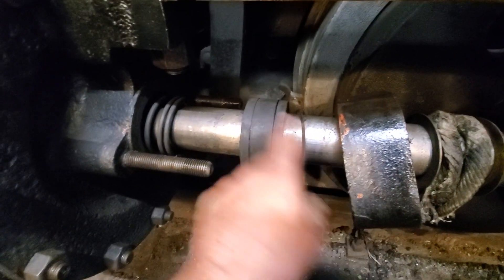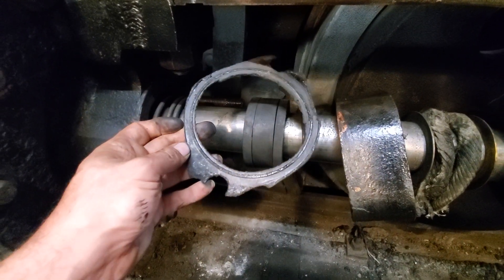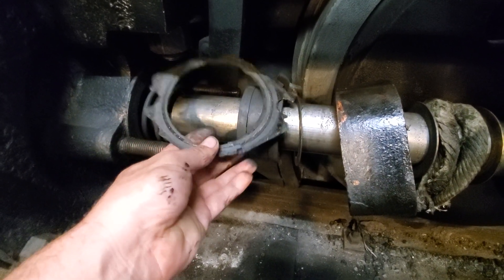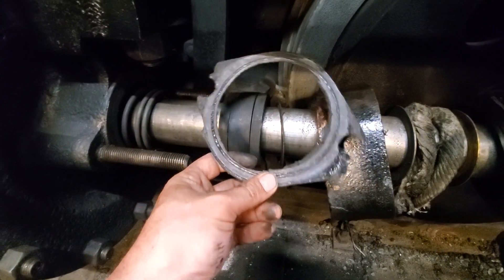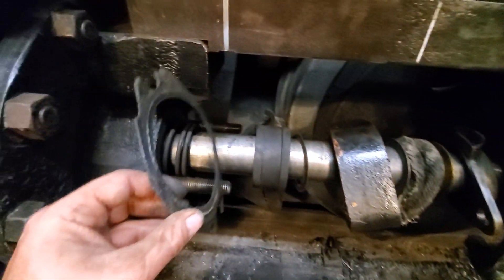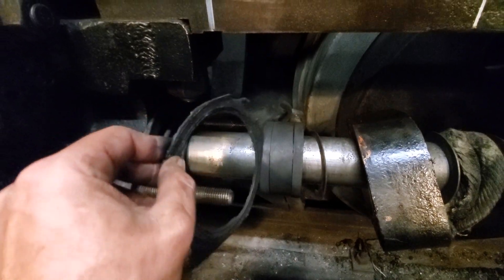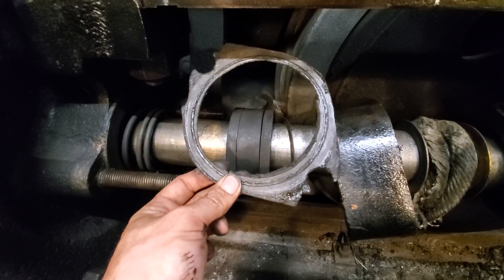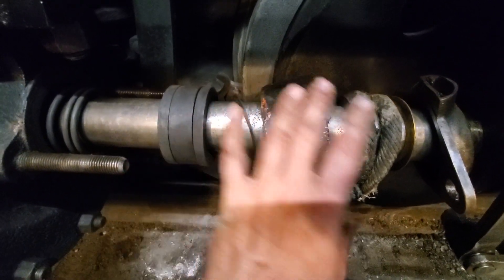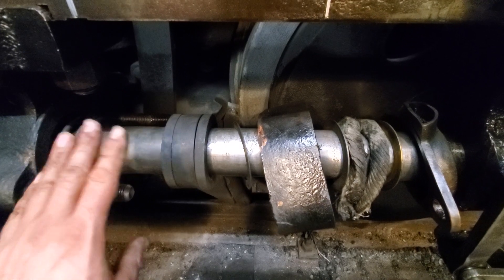The other thing I'm going to do is replace the gasket between the cap and the back of the head. I reused the original gasket from — God knows — 1940, whatever. So I ordered new gasket material and I'm going to trim it and put it in there instead. Now, how do you do that when this is all together? Well, what they did, kind of ingenious, they did a little tongue and groove joint so that you could just pass this over the rod and stick it in place. I'm going to do the same thing with the new piece. So I'm going to make a new gasket, get rid of that brass ring, put this all back together, and the next time we fire up, we'll see if this makes a difference. And if it does, then I know the source of our problems.